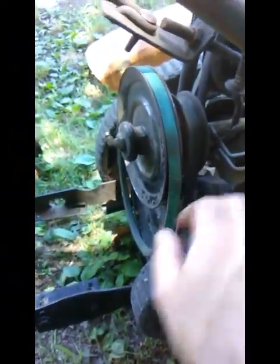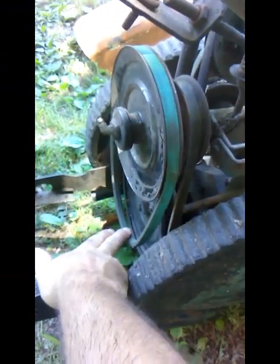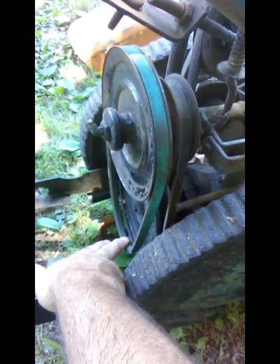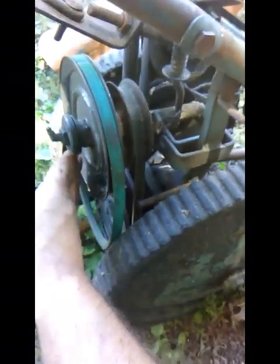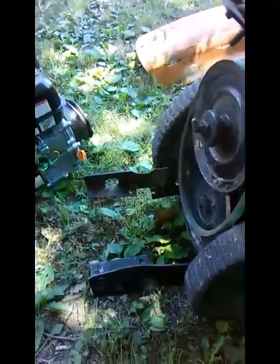I can tighten or engage everything and make sure this belt is tight on the pulley, on the clutch, and everything's in alignment this way, and I can weld that plate in. That way I don't have a bunch of spacers and stuff that I have to deal with, and I should have an even flat surface for that motor to mount to, because this thing's going to get a lot of vibration. So that's what I'm going to do, but first I have to straighten this out.